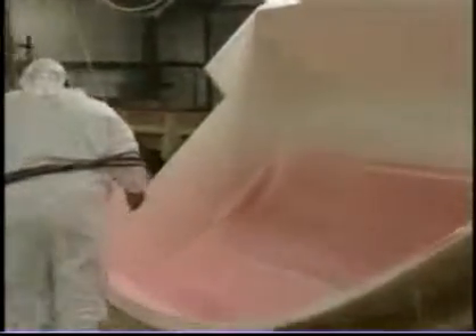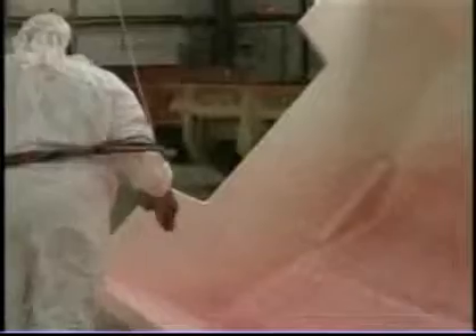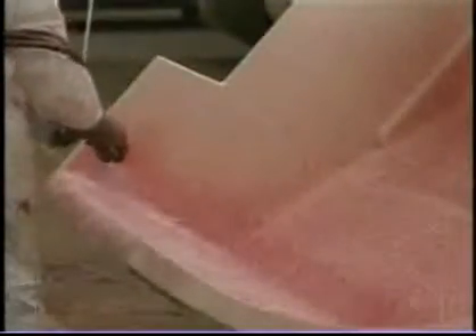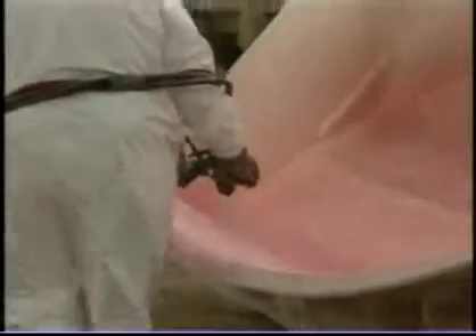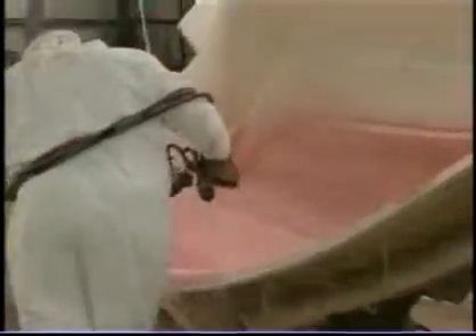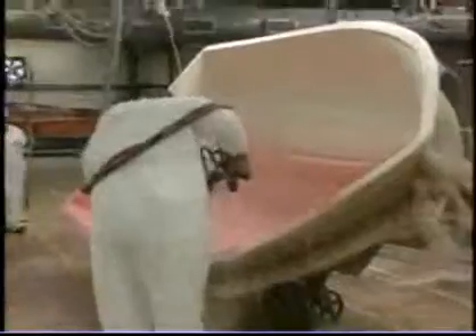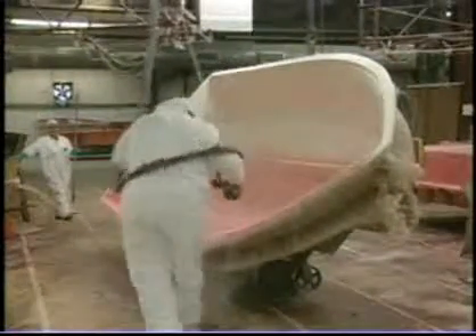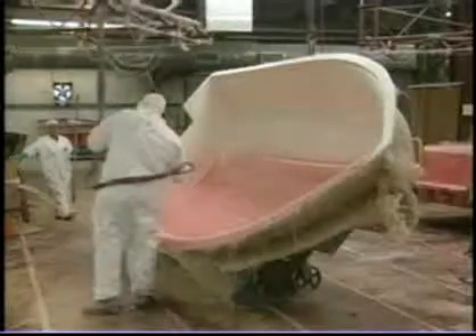When you're putting a chop in there, you don't have to break down the binders of a hand lay. This is the same material as hand laying, but you just have to make sure you have an operator that can put it on evenly. By putting a chop on, you don't have the binders to break down, and you can get a better resin-glass ratio because you're not trying to overwet the mats to break down the binders.